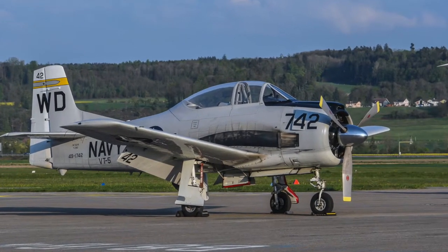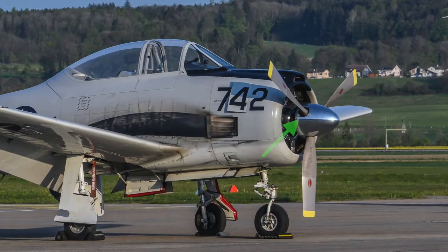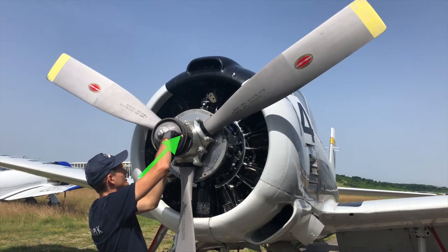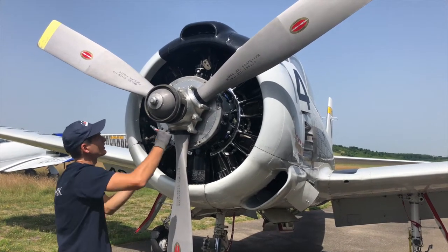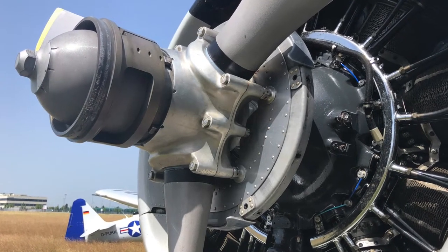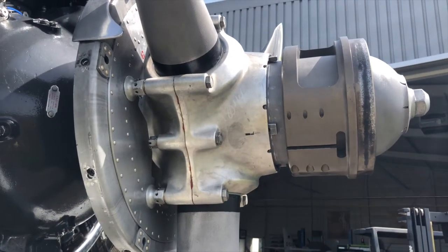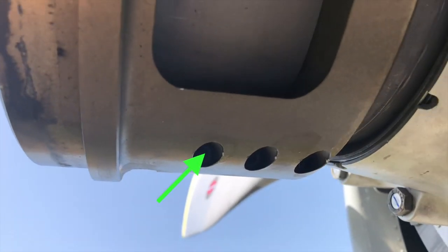In order to remove the Hamilton Standard 3-blade propeller, you have to start first by removing the propeller hood — that's the silver thing here. Afterwards you see a bracket here; that's the next step. This bracket is held in place with three screws, and you can also see the disc where the prop hood was screwed on. To loosen the bracket, these three allen screws must be loosened.